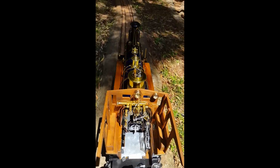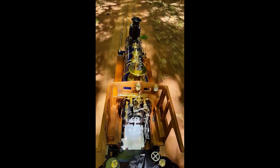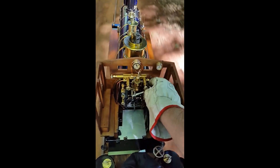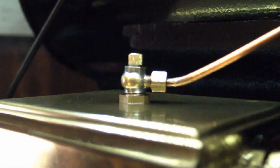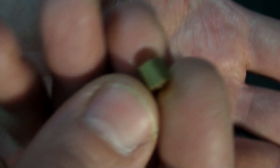Repeatability is actually one of the easiest things to show — if the left-hand side and the right-hand side of the train mechanism aren't the same, the train just won't go. A very nice way to show repeatability on the lathe is all the small little fittings: all the copper components, the steam lines and water lines. I make all my own ferrules and coupling nuts because I want a very specific look for my models. Typically you need to make quite a few at once — it's a batch operation, making 50 or 100 at a time. Every one needs to be the same, otherwise they don't fit up properly on the lines. When all these copper lines go together and fit with no steam leaks, you know you've got very good repeatability.